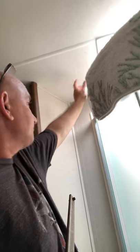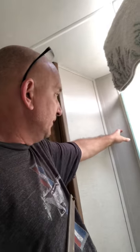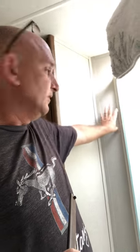For Freedom Express owners — this wall behind the shower has a vent that goes through up top. This wall is thick enough to accommodate a vent, probably at least 2x3 construction, so there's plenty of room up in there. If you look at the bottom, there is an access panel on the base — take these two screws out, pull it out, and there's about an 8x8 inch opening underneath that goes down to the plastic pan. You can also reach up under the shower and access the cavity behind this wall.